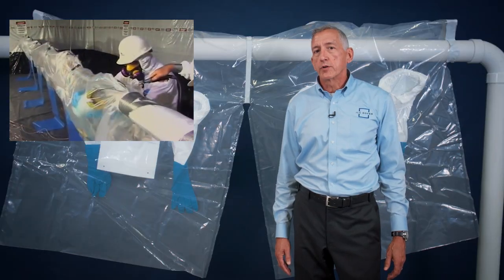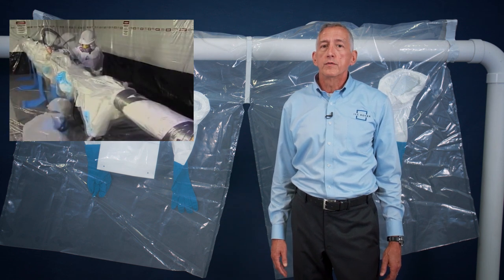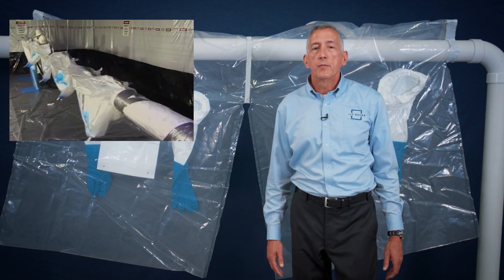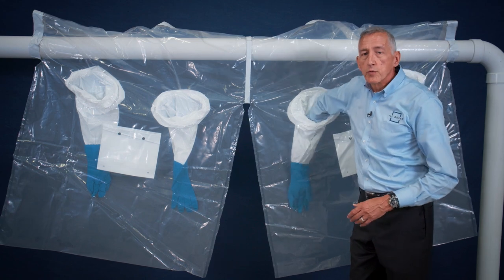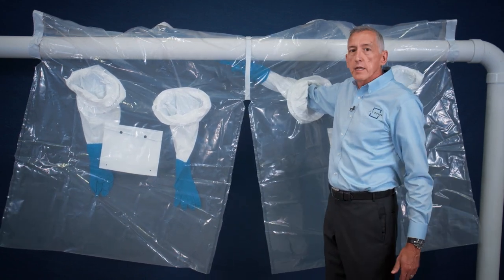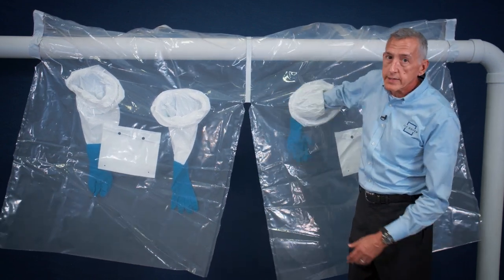The extended run, or EXT style bag, would be appropriate for projects requiring the removal of more than 36 inches of insulation at a time. Because all of the glove bags are connected, several feet of insulation can be enclosed and removed much more efficiently than with individual bags. The primary benefit of the EXT bags is that operators can use fewer bags and less labor because they can work in between each bag rather than having to overlap bags using single glove bags.